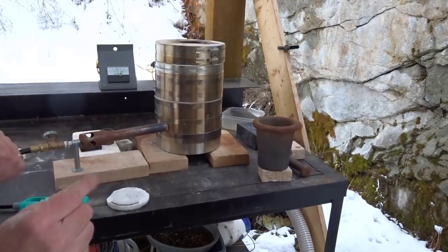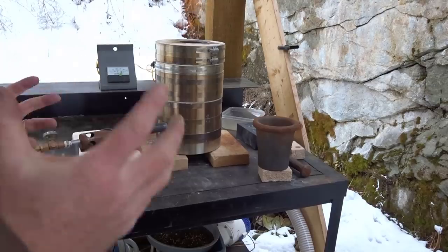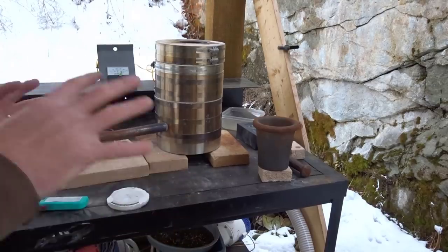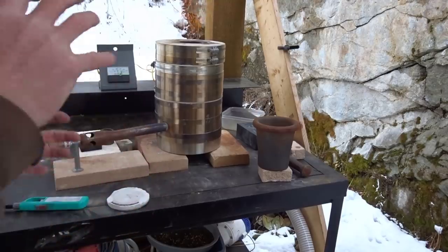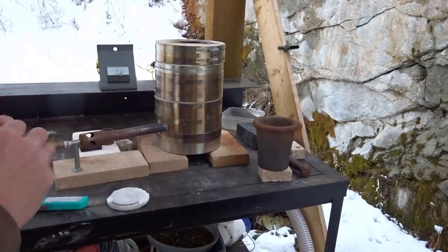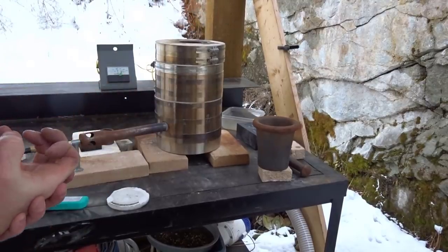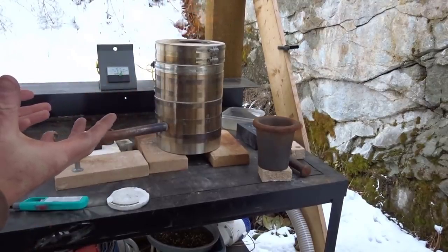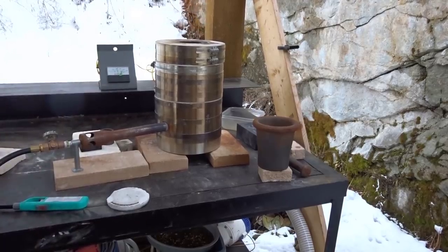We then bring it up to 1,000 degrees and leave it for another 20 minutes. What that does is it makes everything a whole lot more fluid, lets all the gold that has now done its chemical reactions and is up in that flux get more fluid, and that gold sinks to the bottom and pools in the bottom of the crucible. 20 minutes at 1,000 degrees Celsius, and then we can pour it out into one of our molds.